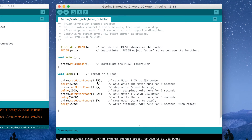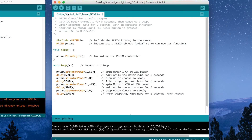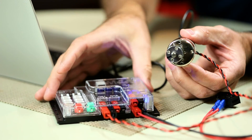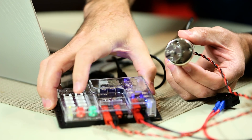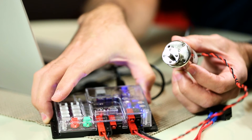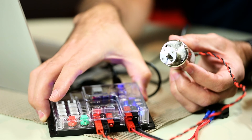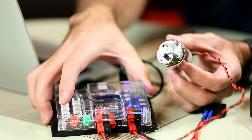The next thing we want you to do is take this example and recreate it — play with the values. Let's do that right now. I'm changing my 25 in the program to 50 on just one side, so it should go faster in one direction than the other. I'll put the visual aid back on so we can see the effect. Uploading — I can see my data lights, done, green light. Executing now — going a little faster that way. Five seconds, going slow in the other direction since I didn't change that speed, then back to the faster. You can see how simple parameter changes impact the sketch.